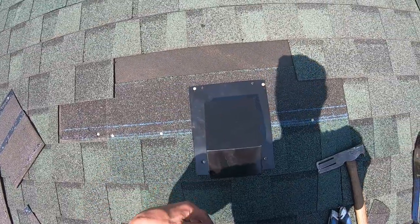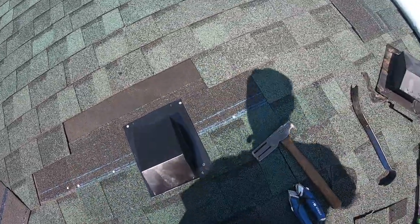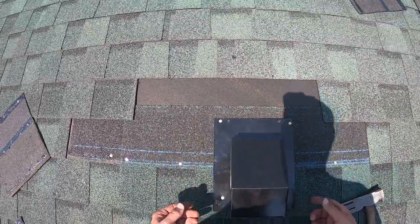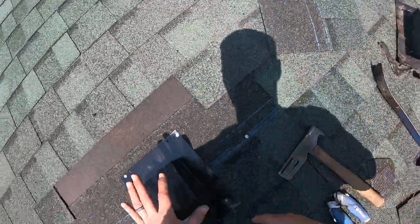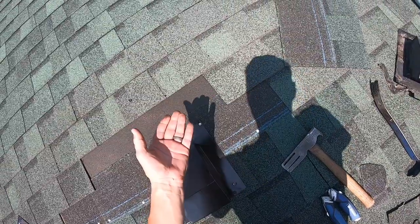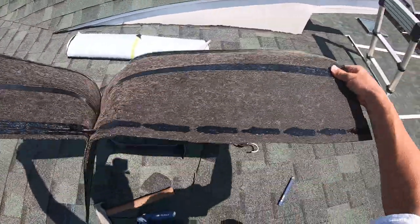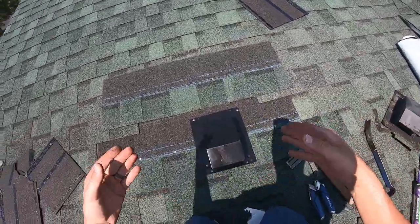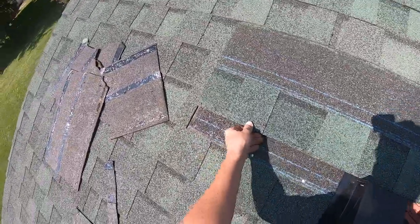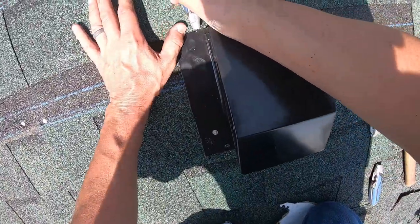You can do ice and water on this if you want — I'm not a fan. I usually put a thin bead of sealer. You want to leave a channel when you cut your shingle for water to run out, and you don't want to caulk it completely because you could trap the water. In this video I'm going to show you without ice, just caulking it. Get your shingle dry fit first — cut it and leave about a quarter inch channel for the water to run out.